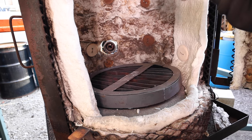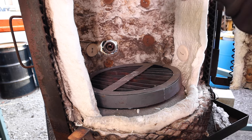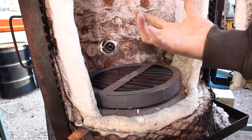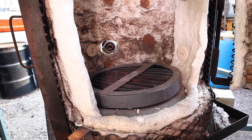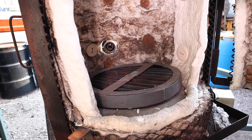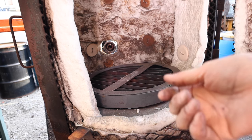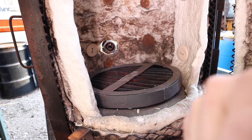Your best option is to disperse that compression over a larger surface — the buttons — as a way to maintain these things together. This is basically just a basic stoneware clay that I wedged a bunch of extra grog into to make it more porous so it can handle the thermal shock more thoroughly. I did an initial bisque fire on them, applied them in here, and most of these buttons — especially the darker ones on the back wall — have been there for 15 years.